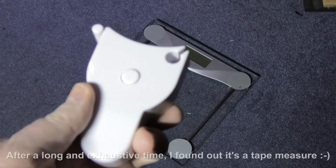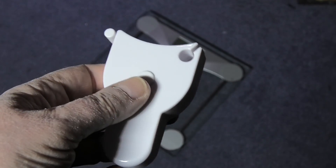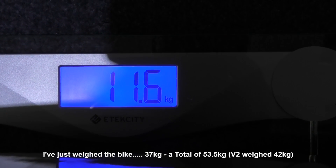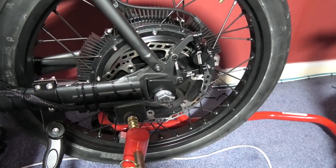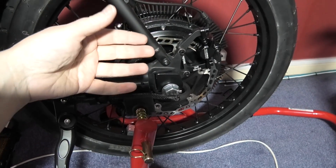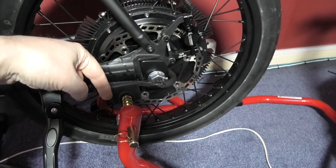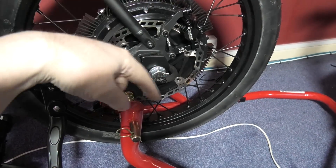What the hell's this? It's got a button. I need it. So I'm going to weigh the battery. I'm quite disappointed - I thought it was double that. That's quite impressive actually. I've been balancing the wheel. The way I do it is dynamically - you can't just tick it off. I spin it up, get some weights, put them at various points and see if the vibration increases. If it makes no difference wherever you put it, you add more weights and keep going around until you get it perfect.